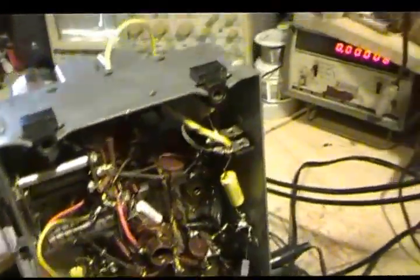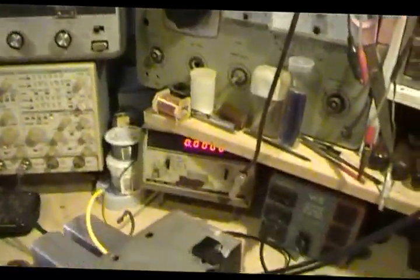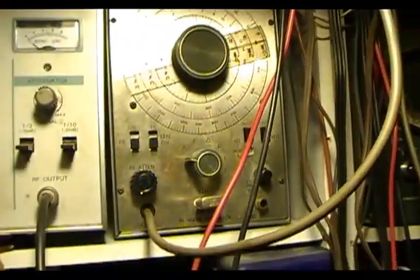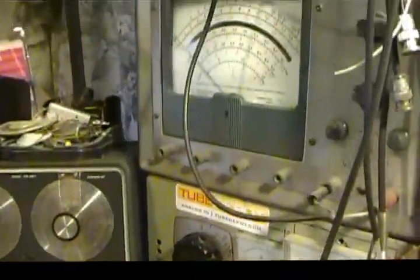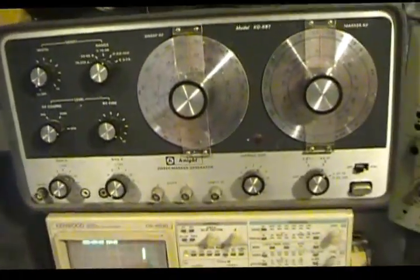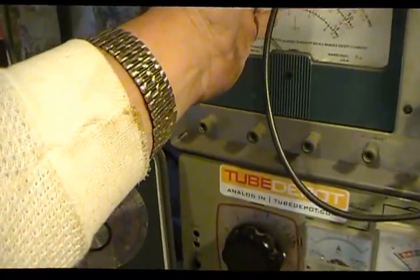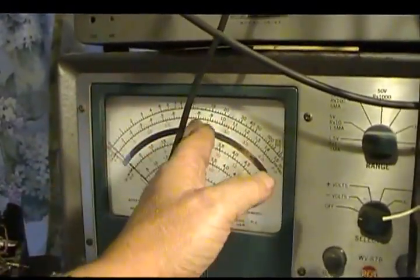So anyway, I wanted to be able to adjust it, but probably not in this video because we're getting long. I want to use this and show you how to do that. At this point, I'm going to cut this video off. It's going to be 4 parts because I want to get this guy hooked up on the next run, and then we'll try to do the last bit of the FM. As far as the IFs go, this is no different than this. Here you're trying to get it as high as possible and as steep as possible. Here you would be just trying to get the meter moved over as far as possible, the highest reading.